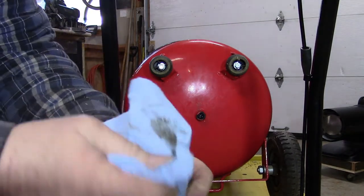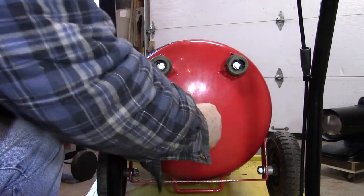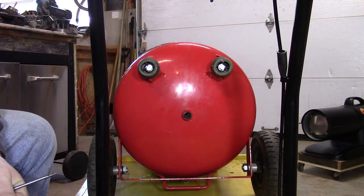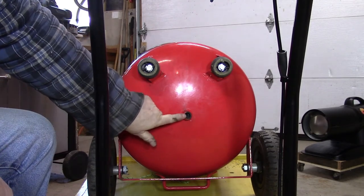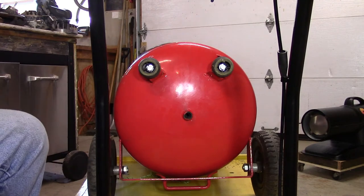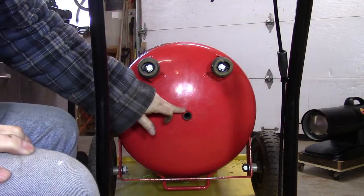There's a little bit of sludge in there but not much. What's in the bottom of that? This video is turning into a lesson on what happens to your compressor if you don't do regular maintenance. There's a film of sludge and rust built up at the bottom of the hole that plugged it off completely — I had to take my awl and punch a hole in it to get through to let the air out. That's just what happens if you don't drain the water out of your tank on a regular basis. Lesson learned for old Grampy here.